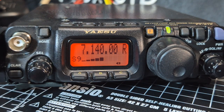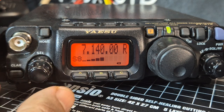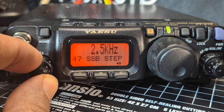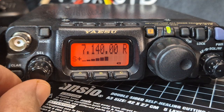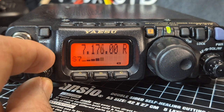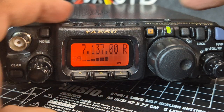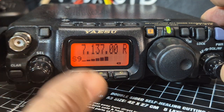Attenuation, noise blanker, your power setting, and break-in for the CW key. There's the large display, which is good. You can press this button and change the step — hold and look for SSB step under S. Change that to 1 and back out. The screen is small but very usable.